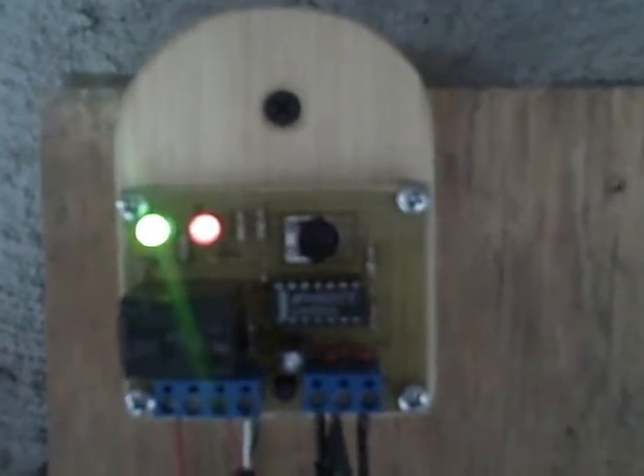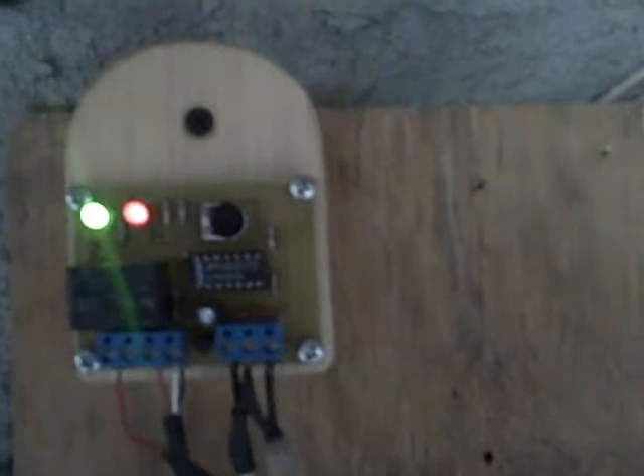It's 5 p.m. and our pump is still on. It looks like there's still plenty of heat available. You can tell by how bright the red light is glowing. The green light, of course, indicates that the pump is on. This is the return line from our pump — can you hear that trickling down? This is our drain-back system, so the water comes down here. The pump is on because there's plenty of heat available, and the collector is much hotter than the cold storage tank.